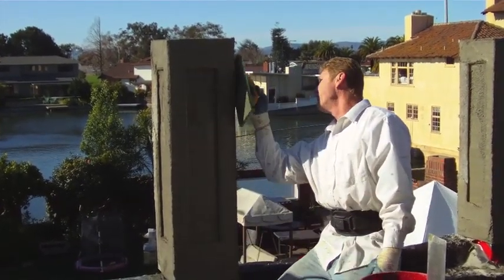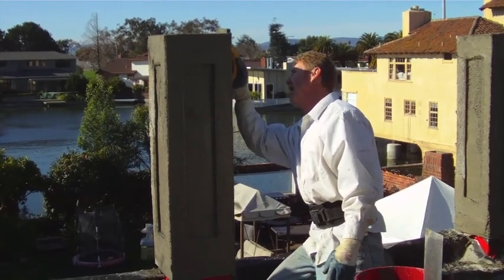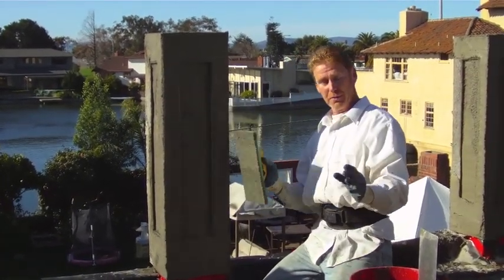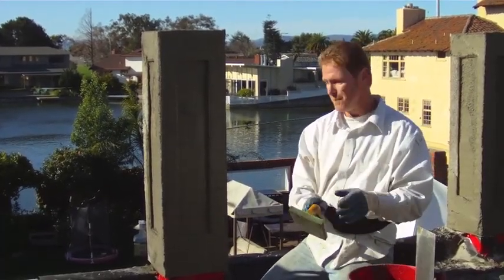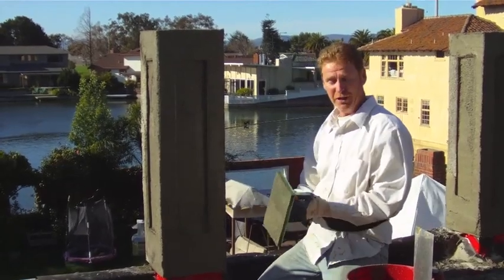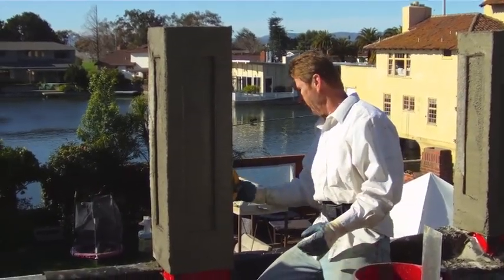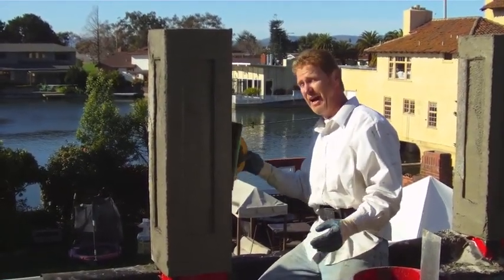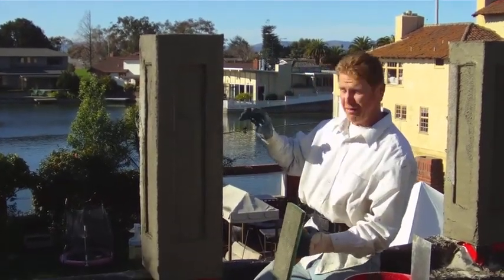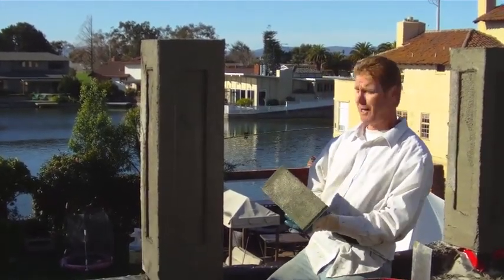That's the beginning for the dash. I'm going to dash these — dash means I'm going to blow on a finish coat. When I blow on the finish coat it's almost dashed — I just barely hit it with the finish and that'll be nice. On a windy day like this I don't want to dash too much, because as I hook up the hand hopper and shoot, that stuff goes everywhere on windy days.